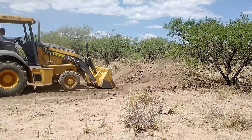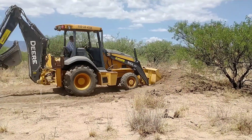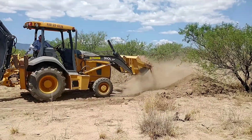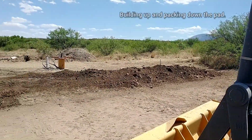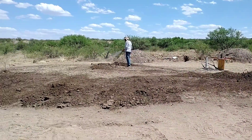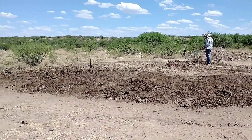Our new more conventional plans will actually include a little better insulation. The R value in the wall will be R19 and the R value in the roof will be R38, so we're doing quite a bit better with the conventional home as far as R value. We'll still compare the two together.